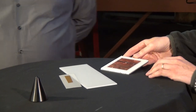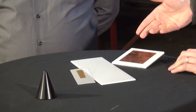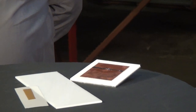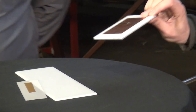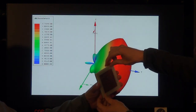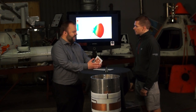This is where our new innovations come into the picture. If we start with some basic concepts, we looked at a standard patch antenna. A patch antenna is basically a square of conductive material — in this case copper tape, so it's very thin. And a ground plane. Normally you can elevate it by air, or foam usually, because you can't do it by air of course. In this case I've used some plastic, and then you have an antenna that radiates like this. The back plane is always very important because it really guides the direction of the radiated energy — it's like a reflector.